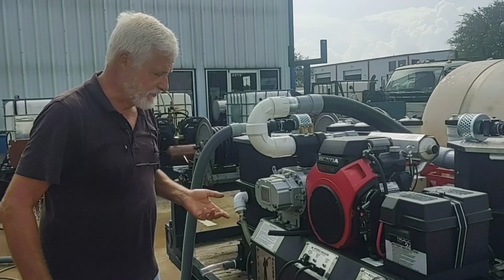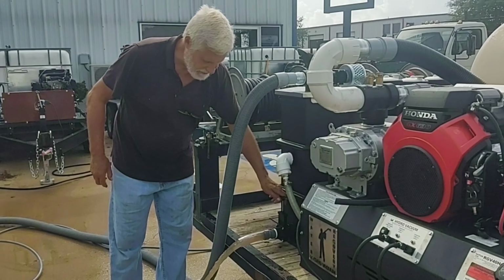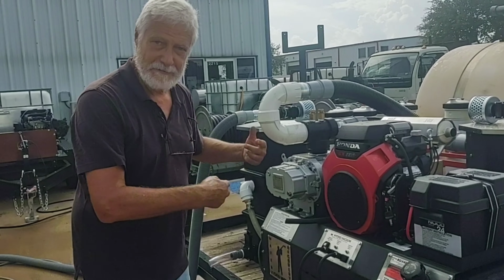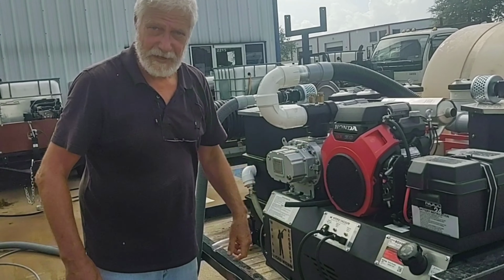So basically, if you encounter that situation, all you have to do is drain the tanks for any residual water or turn on the switch that you had forgotten to turn on initially, and that will activate the pumps, drop the level to a safe point, and then you'll be able to fire the engine back up.